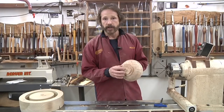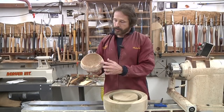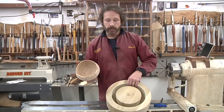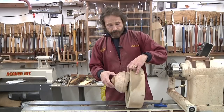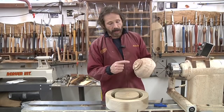One of the things I would normally do is make a jam chuck, especially with a piece like this because of the natural edge, which would make it difficult to reverse mount directly. Because I put this band on here, I could make a jam chuck with a face plate on one side — I'd turn a block of wood appropriate for this piece, and this band would reference up against that edge, fitting inside the jam chuck. Then I could bring up the tail stock — I still have my center, which is important so I can get back onto that axis point. That way I'd be centered and could come back in and turn the bottom.